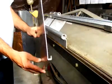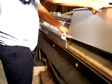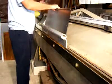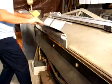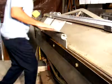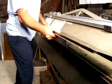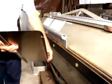In this step, we're still using the angle shim inside the T slot. When you do your U-shaped bend, you have to load this piece of material in from the ends rather than push it in from the face of the die. This material won't fall out when forming, and you'll have to unload it as well by pulling it out from the ends. Now you have a U-shaped flange.